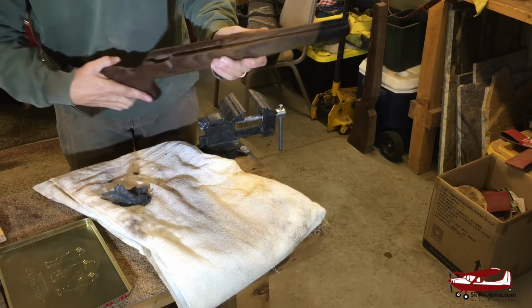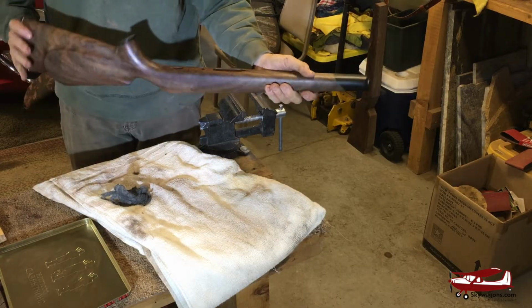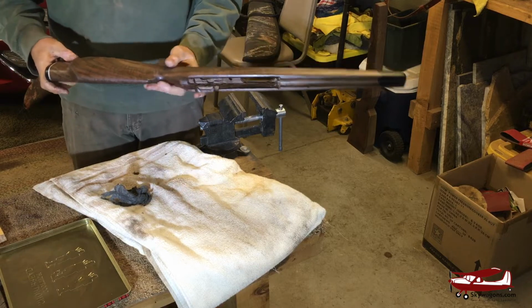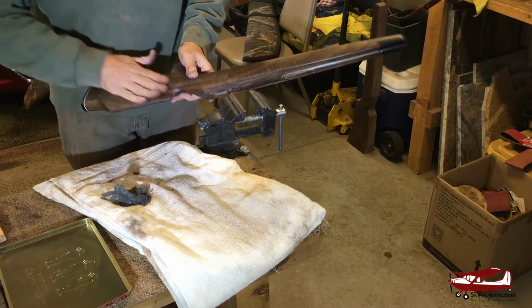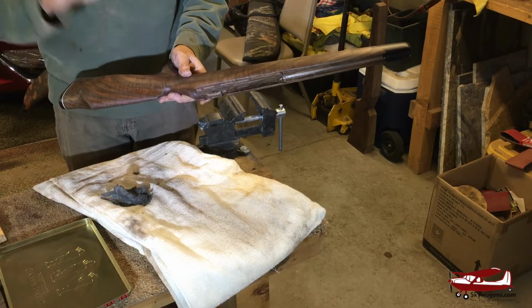So now when that's dry, I'll probably sand it really finely to knock the top off the grain that's been raised with something like 400 grit, and then repeat it until the tiny pores are flush with the surface, and the sanding removes the wood back down to the surface of the wood but leaves the pores full.